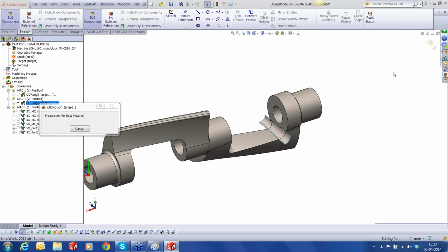Now, if you use regular conventional 3-axis machining, there are several issues that you would encounter. First of all, the parameters itself. What would be your ideal RPM? What would be the roughing feed rate, etc.? What would be the strategy you would use? Would it be good on the tool? Would it be good on the spindle? There are several things, and that is the reason why I have used iMachining.